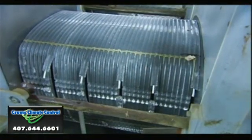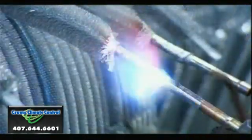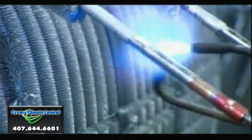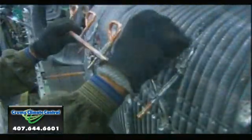The pipes that feed these circuits are made of copper, but copper doesn't fuse directly to aluminum. So workers must first solder on transition tubes coated with a zinc aluminum alloy.